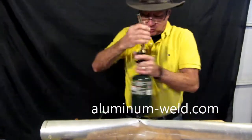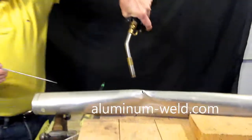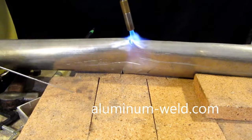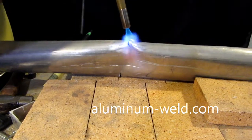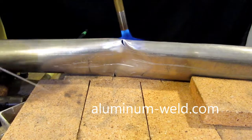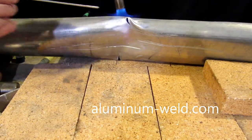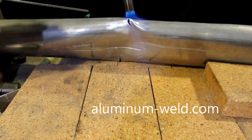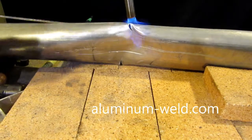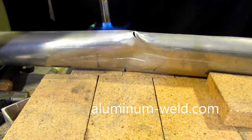I'll get my torch and grab one of the HTS 735 brazing rods, and then I'll apply heat to the area I'm going to make a repair. Move the flame off to the side and check it. Very important: do not put the rod in or near the flame. The aluminum must melt the rod, and that's very easy to do because the rod melts 500 degrees before the aluminum does. So you can make a repair, walk across that muddy field that you cannot get a truck or welder into, and go ahead and make a permanent repair on these cracks.